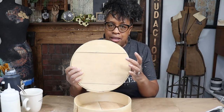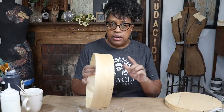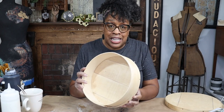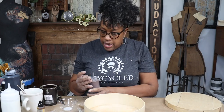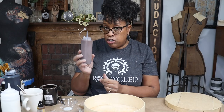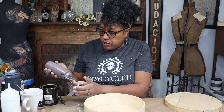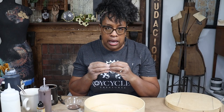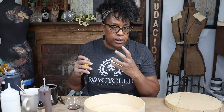I'm going to have to paint the top because I do want to decoupage the top, but I don't want to decoupage the rest of it. I want to leave the wood grain, but I do want to darken it. So we're going to use Wise Owl's glaze to actually stain the wood. I have Wise Owl Java here — it's a really rich brown. Sometimes I'll add Wise Owl's Black Walnut to my Java to deepen the color, but today I'm just going to use the Java by itself because I want a pretty warm palette.